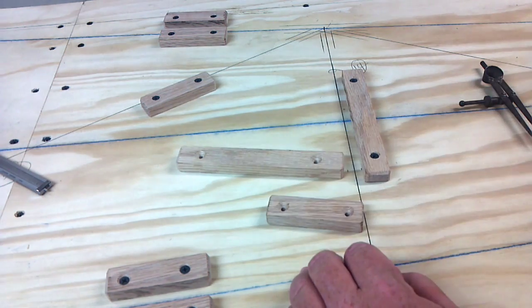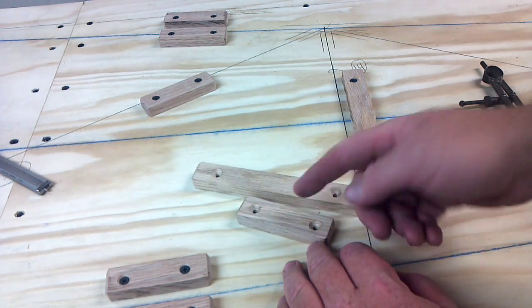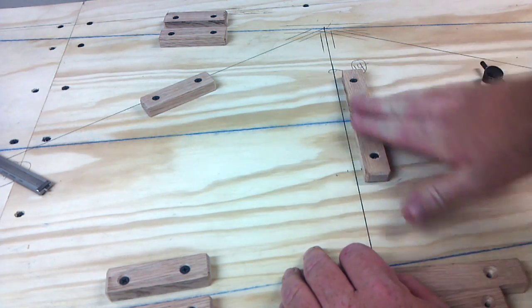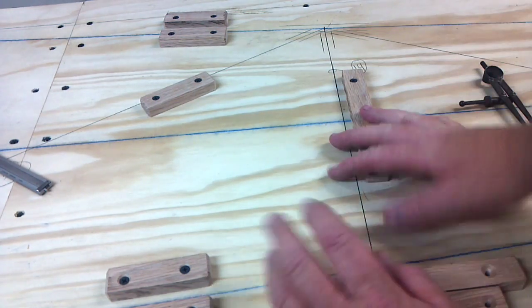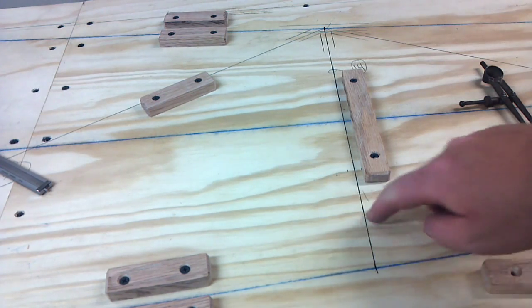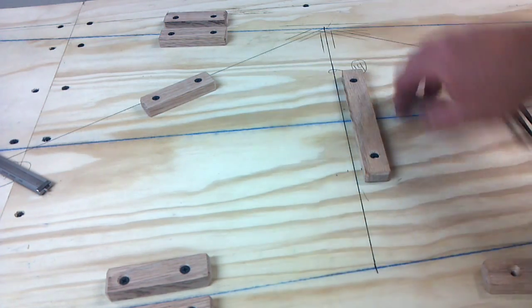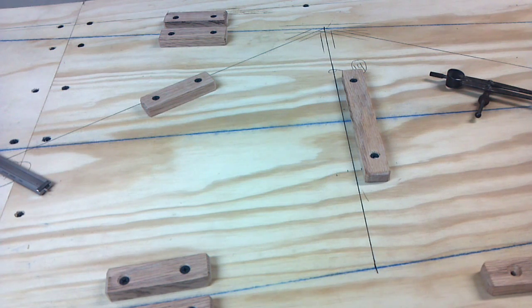Regardless, they're about one inch wide. I have different lengths — three inch, six inch, one inch. Sometimes you're better off putting a long one in instead of two on each side, total of four. It's just a lot of work and there's no point in doing it. A long one right here is nice because you can still torch this, weld it up, and it's long enough to really support it.